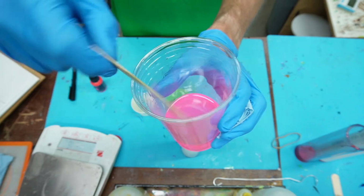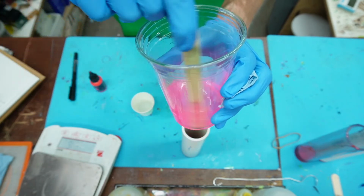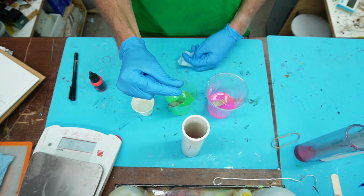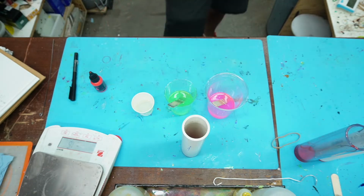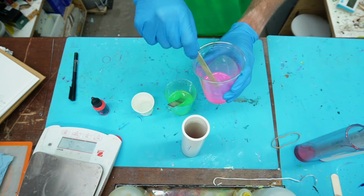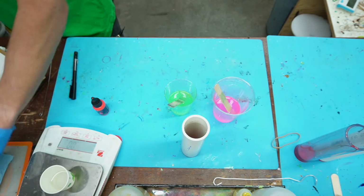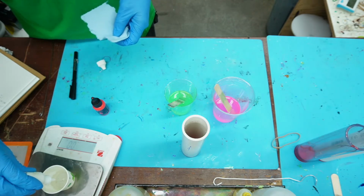There's almost no pink tint to that resin, which means you need to add a whole lot more dye to get the same effect. And again, that just has to do with the material thickness and how much color is actually going to show up in that. So for pen blanks, and same thing with micas, it may look super saturated when you're mixing it in the cup, but the reality is there's barely any color that's going to be apparent once you've turned it down to that 1/8 inch thickness. So we need 3.3 grams of white.